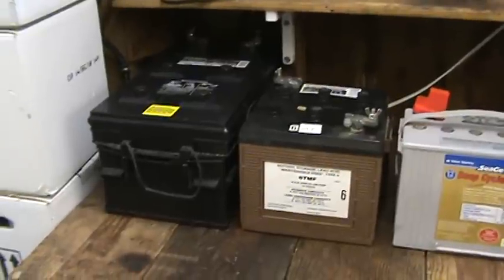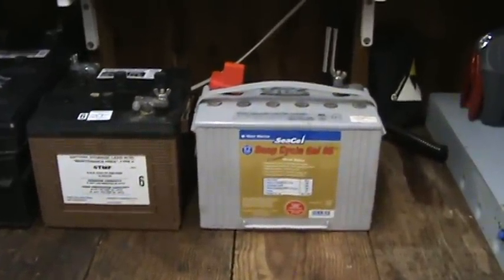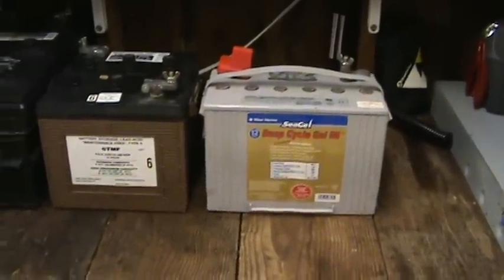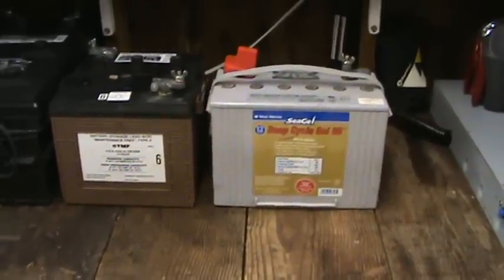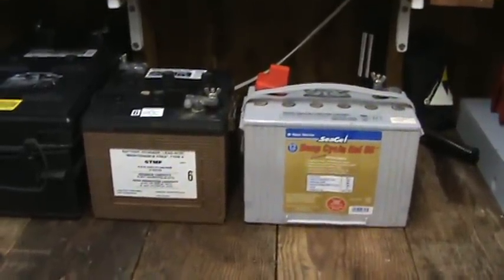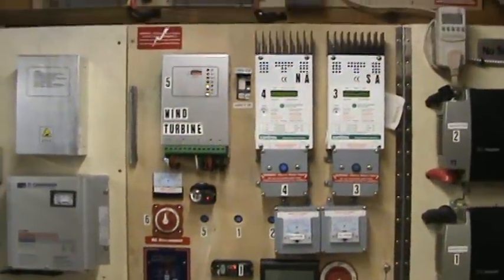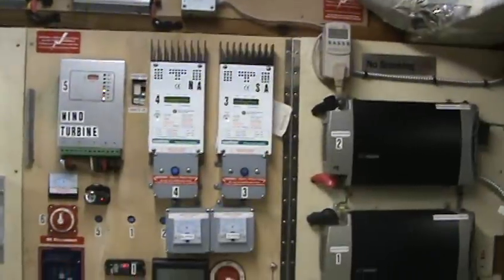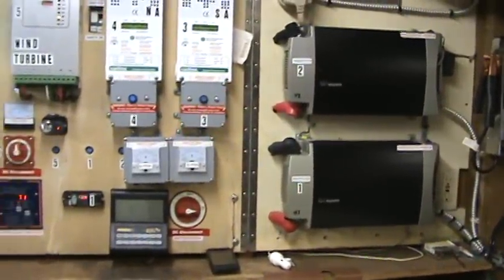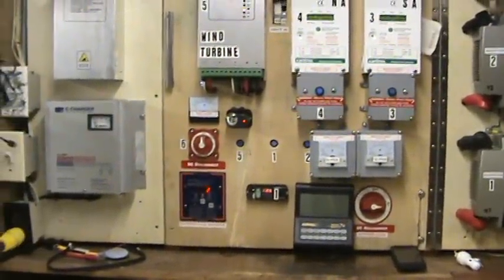Anybody who's setting up any system — whether it's Harbor Freight or anything like that — if you see a battery at Walmart that says 'deep cycle,' it's actually a dual-purpose battery. The way you can tell is it's going to have cranking amps or high discharge capacity on it. Golf cart batteries don't have any of that stuff and they can be had fairly cheaply. Ask me some questions and I'll try to answer them. I apologize to anyone who's been commenting on older videos — for some reason it doesn't notify me, but I try to go through those every now and then. I hope this was helpful and we'll see you next time.